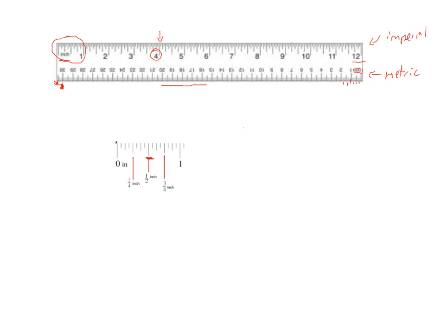That one is located exactly halfway between 0 and 1. That would be half an inch. So the longest tick mark corresponds to half inch, as it says here. And then if we look halfway between 0 and 1/2, you'll find the next biggest tick mark, and that's what we call the 1/4 inch. So each tick mark that is this size, this long, represents an even 1/4 inch.